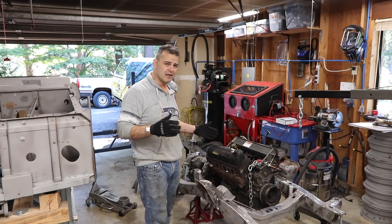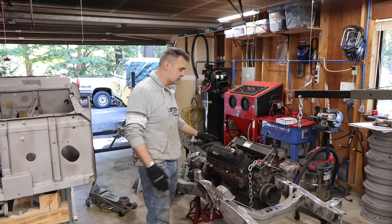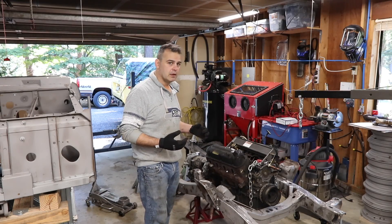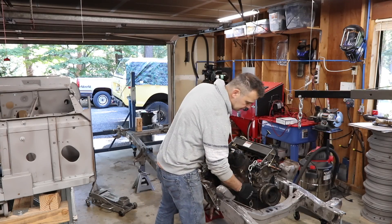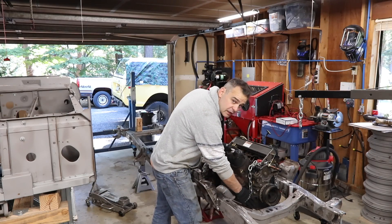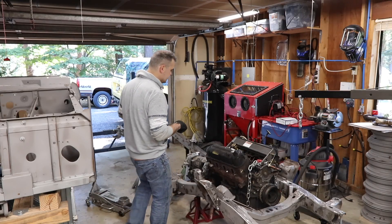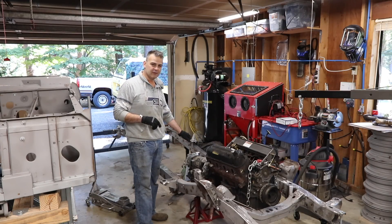In previous episodes, you saw I bought a '97 Ford Explorer with the 5.0 and the 4R70W transmission, which is what I've got here. It's not a direct swap. So what I'm going to do today is show you guys what you need to look for and what fab you need to do to get it to work. I'll also check the accessory drive because I've seen it interfere with the crossmember in other builds, so I may need to notch the crossmember to make room for an idler pulley. Most of the work is out back with the crossmember and the Advanced Adapters kit.